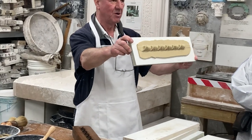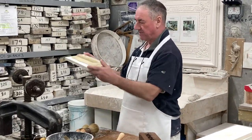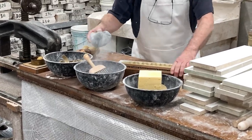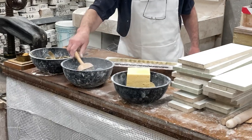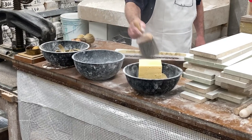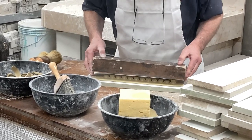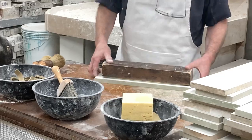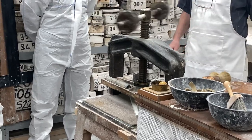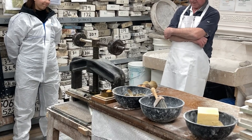You'll notice a big difference in the next two pressings. This time, instead of the oil, with a little bit of French chalk — another release agent. It just dries it up a bit so we don't saturate it with oil, otherwise it gets a bit shiny and slippery. So it's just to help it come out of the mold. Try and get the mold exactly back where it came from, pop it back under the press. Give it another turn and leave that for a minute.